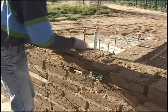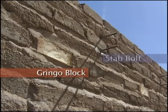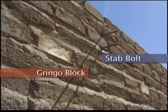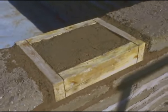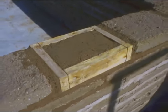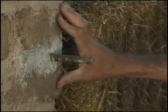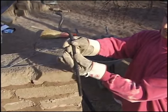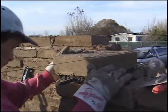Sometimes it's necessary to attach another wall, such as a frame wall, to the adobe wall. There are a couple of different ways of doing this — you can use a gringo block or what are called stab bolts. A gringo block is made out of two-by-fours and is just a hollow block that is inserted in place of an adobe and then filled with mud. This gives something to nail into, unlike the adobe block which does not have structural strength for taking nails or bolts. A stab bolt is embedded between two courses of adobe in regular cement mortar. It has a slight S-pattern to it, so when set into mortar it's going to be rock solid for the structure.